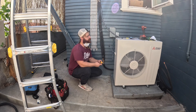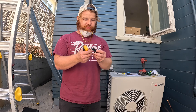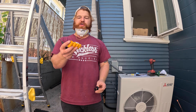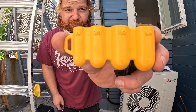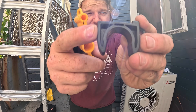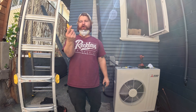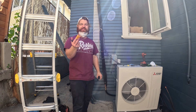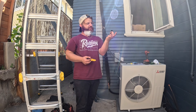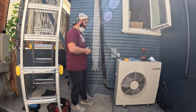They sell connectors all the way up to seven-eighths inch, but there's a separate support kit for seven-eighths and three-quarter inch pipe. The standard depth marker covers quarter inch to five-eighths inch. The seven-eighths and three-quarter ones are sold separately. The support kit up to five-eighths is about 18 bucks, and the support kit for the larger two pieces is about 14 bucks.